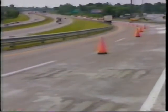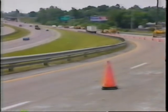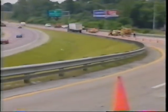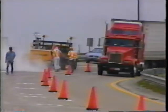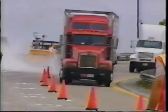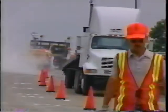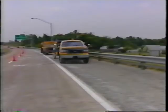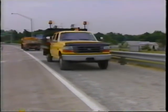In an 8-hour day, the milling machine was able to cut over 330 slots. Traffic was maintained in the adjacent lane to minimize any inconvenience to the motoring public. Curing compound was applied on the surface of the mortar patches after they had set sufficiently. This work was accomplished by the coordination of the Division of Materials and Tests, the Greenfield District's Indianapolis Subdistrict, and Keystone Engineering. The intent of these installations is to establish load transfer across the pavement crack to avoid pavement faulting